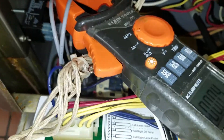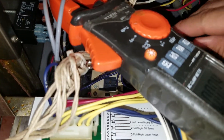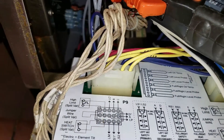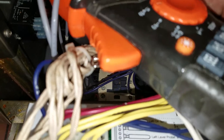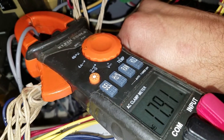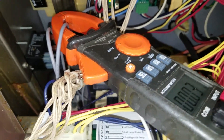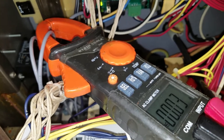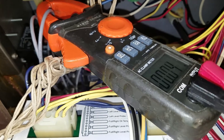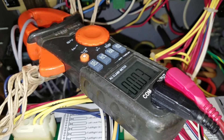Alright, with the meter on, check your amp draws. I press in the middle portion of the contactor to engage it manually, and look — the amp draw is almost 18 amps. I went across the other ones and got just about 18 amps, which tells me it's working fine. More than likely they had too much oil in it or it wasn't plugged in fully. I'm going to go ahead and reset and clear the error code.